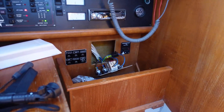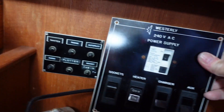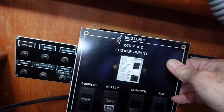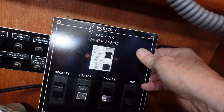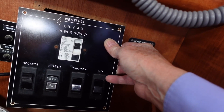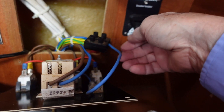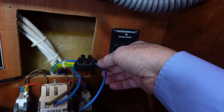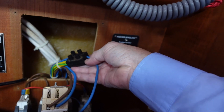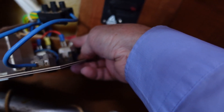It's fairly easy to get cables from here to the 240V AC switchboard, and fortunately that has a spare switch to connect to. Similarly, the house battery bank is just the other side of the bulkhead. This is the AC 240V power switchboard on Zephyr 4 - fairly basic - and there's a spare switch, contactor, whatever you want to call it, just here called AUX, which isn't being used. Behind the scenes it's fairly straightforward. The neutral line is here, all the earths are joined together here, and I just need push-on connectors for the live.